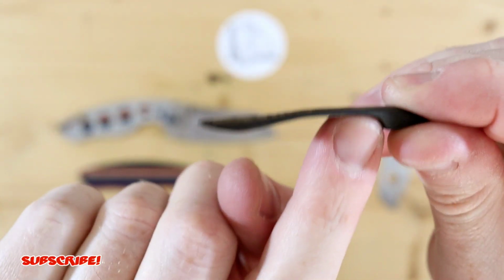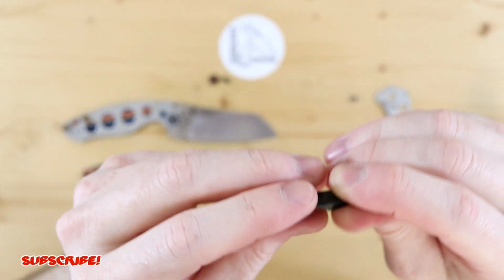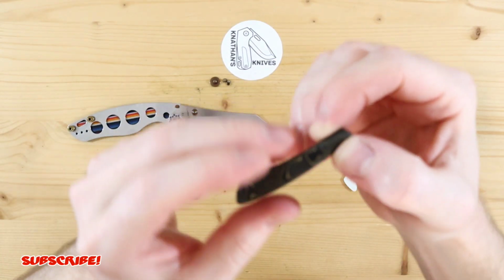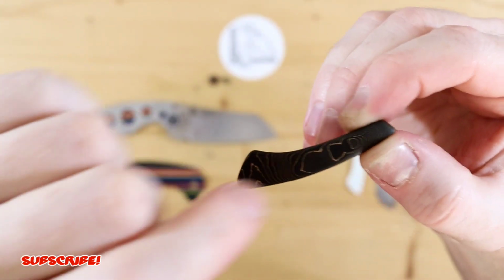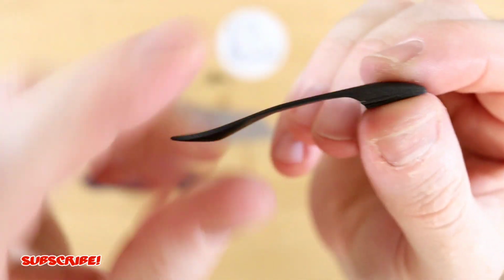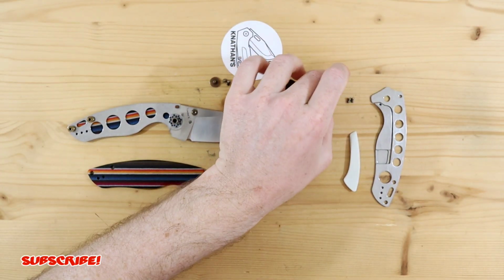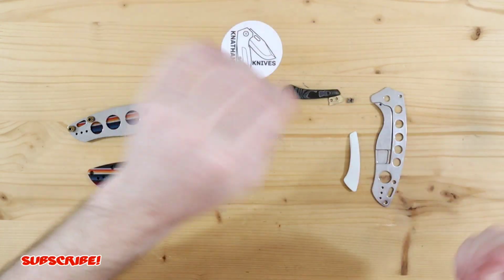I'm surprised it didn't snap right here where you have the tension. So it is strong enough, and I do trust carbon fiber, let alone G10, which is the new one I created. So I'm sure if I went from the top end all the way through and then countersunk from the top, this clip would have broke on the tension area.